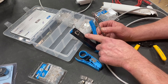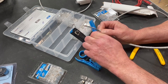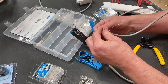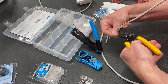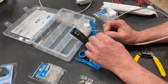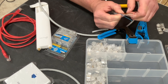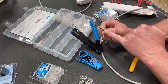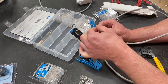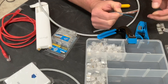So let's leave that in front of ourselves and look at layering these in the correct order. System B is the most common one in Europe. We're going to start with orange and white — take the orange and white, get it as straight as we can. Next one down is orange, take that one and lay it on top of the other conductor. Keeping them tight with my fingers — we've gone white and orange, orange. Next is white and green, take that, make sure it's nice and straight, and lay it on top of the others, straightening all three out at the same time.